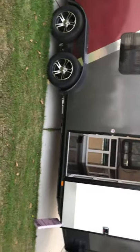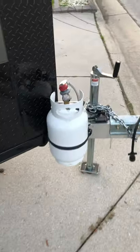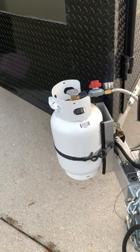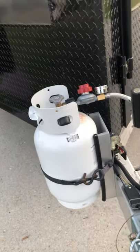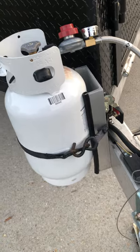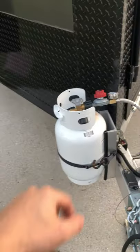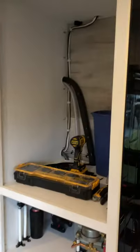The custom plastic tanks are about the same cost as RecPro tanks but much sturdier and stronger — I was actually able to jack the entire trailer up using those plastic tanks with a two-by-four to displace the load. For the propane tank, I got one of the small propane tanks — not full-size — and just mounted some aluminum channel to the side with slotted rubber tube. I'll replace that with pipe or ducting straps to go around the outside. A lot of the trailer propane tank mounts are around $150; mine was about $30.